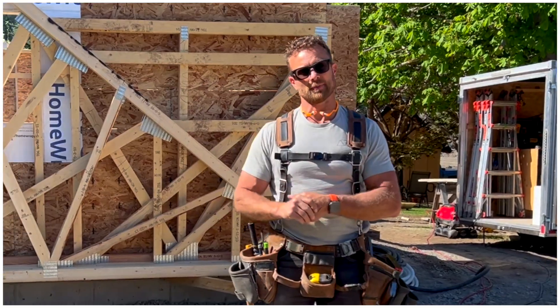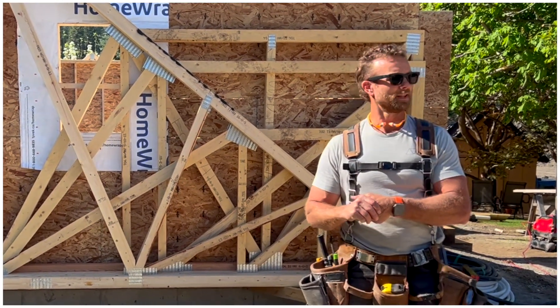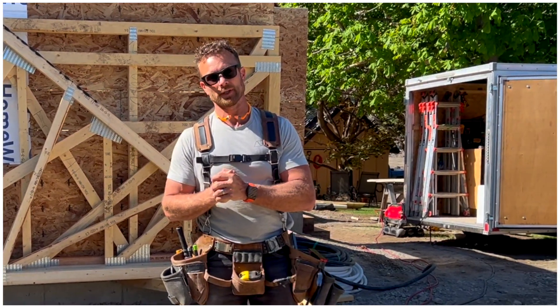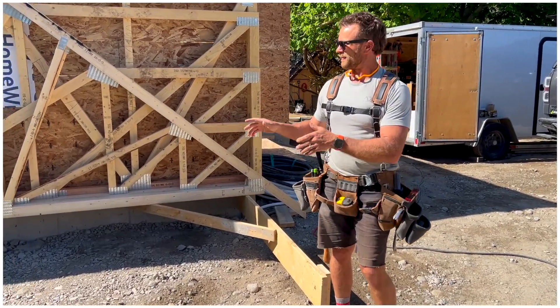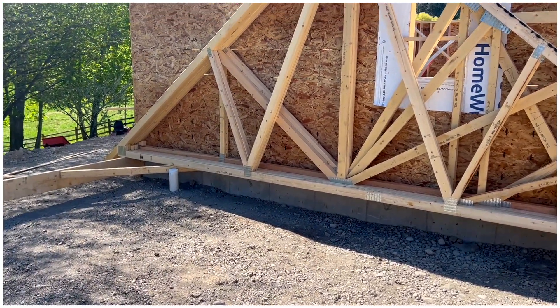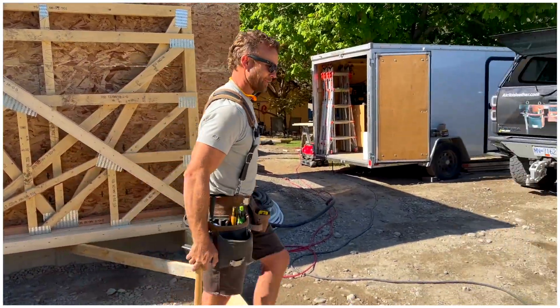Time to get trusses up. I'm going to prefab a whole section here and go over my process to make it easy, controllable, and accurate. First order of business is to get all your trusses organized. We've put a couple of 2x10 beams in place and stacked all the trusses in order that will be going up, and we've set up a couple over here to get the gable end prepared.